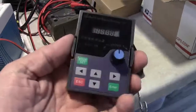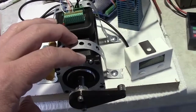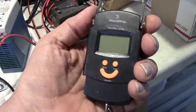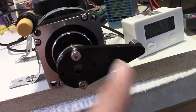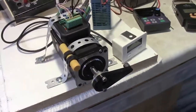There's also a little extra box to change internal motor settings — you run a cable from the back of the motor into this connector to change additional characteristics. I'm using the motor out of the box without changing any parameters with that external device. To measure torque, I have a luggage scale. I've 3D printed an index arm about one inch from center, so I can measure how well this motor holds 16 pounds at one inch — i.e., 16 pound-inches of holding torque.